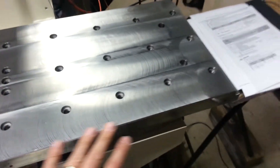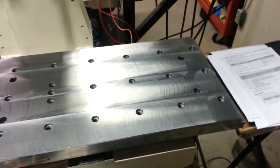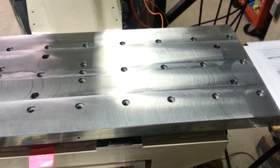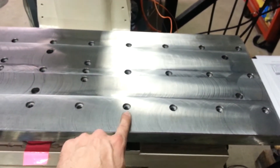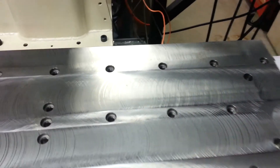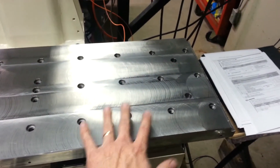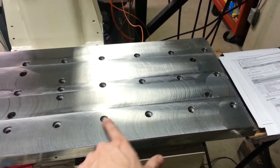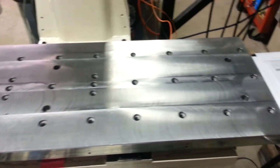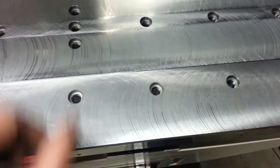I had decided to not use T-slots on my table just because it would weaken it so much, and decided instead for a modular tooling plate approach where I've got half-13 tapped holes for clamping things down and 5/8" diameter machined holes for locating fixtures. I like that approach where you can put something on and accurately move it around — these are four inches apart — and preserve orientation, but since they're blind holes they would be miserable to keep coolant and chips out of.